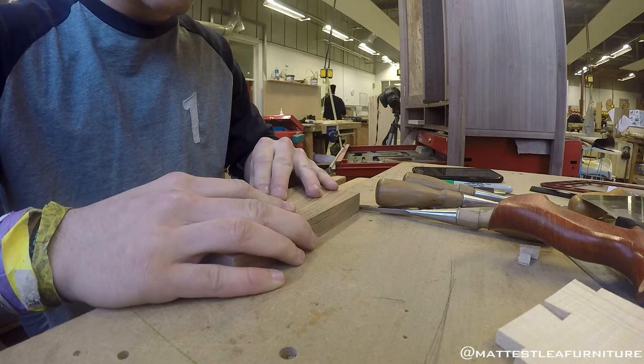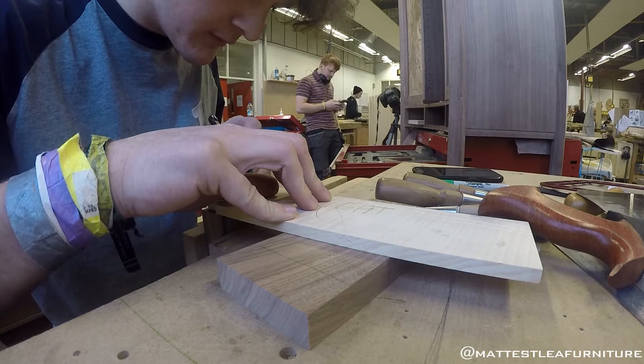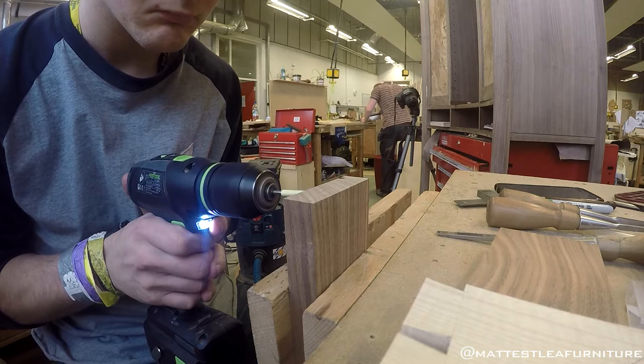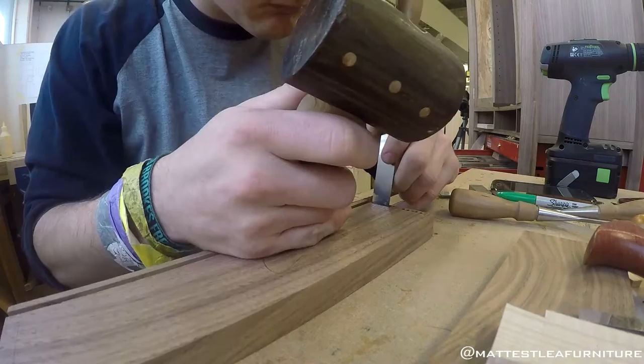To mark the tails onto the drawer fronts, I get a component that's level behind it so I can rest the tails on that, get everything nicely lined up, make sure it doesn't move, and mark around it with a sharp knife. In this case I'm using a Swan Morton blade — I think it's the SM01. It's incredible for marking dovetails because it's a slightly thicker blade, it doesn't flex, and you can actually resharpen it because it's got a bevel on the back. I'll put a link in the description — they're very good and very cheap.